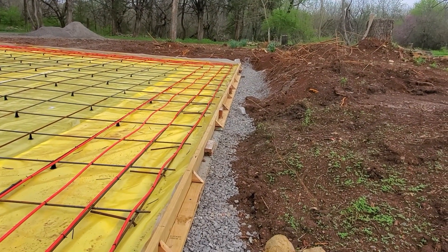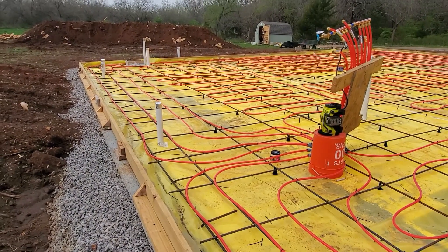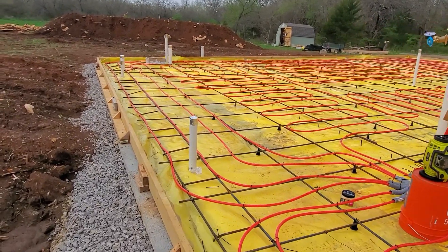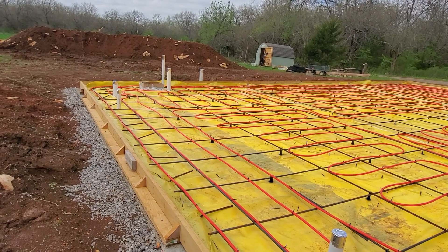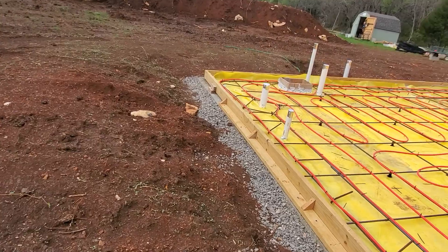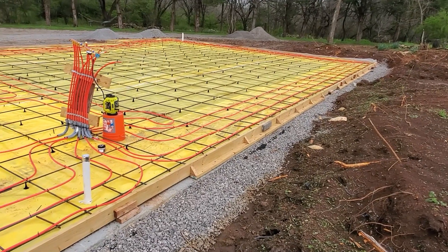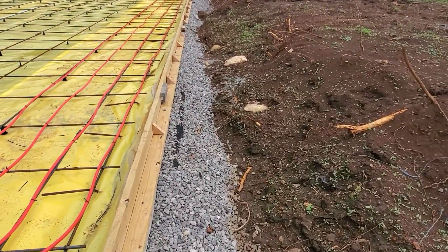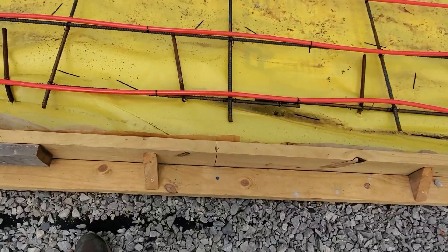What I did is put this in AutoCAD and ran it as if I started a wall from either end, lined up all the studs where they'd be centered, and then determined that wherever I put an anchor bolt — no matter which way I frame it — I shouldn't have an anchor bolt landing on top of a stud. Back when I used to do construction, someone just walked around and stuck anchor bolts every couple feet. Problem with that is you end up having to knock an anchor bolt out or move a stud over. I'm trying to avoid that. It's kind of an experiment but it's working great — if not, I just lost maybe a half hour of my time.